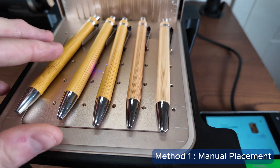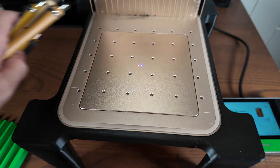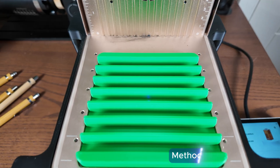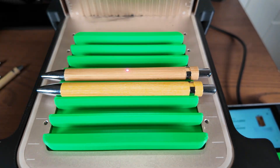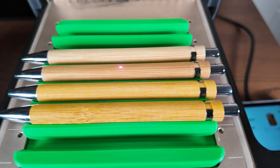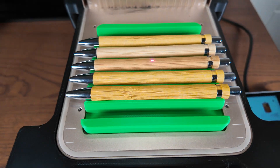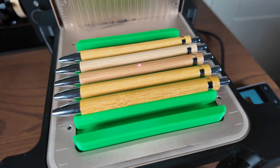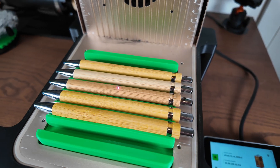In terms of actually mounting these, you can lay them on their side and engrave them, but it is challenging and difficult. As I show in most of my videos, jigs are often a really simple but effective way of getting consistent and quick results. In this case I will be using a jig and we're going to engrave five of these in succession to demonstrate an accurate use case for bulk production.